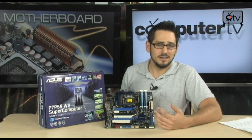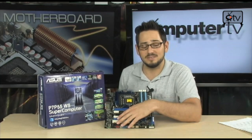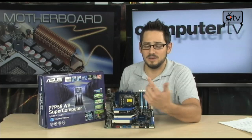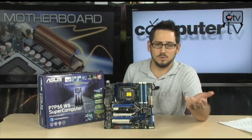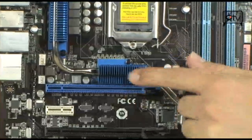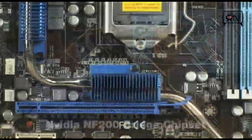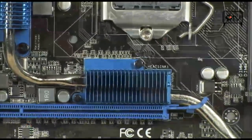How did they get a chip that only supports 16 lanes of PCI Express to have five PCI Express X16 slots? Like, how's that going to work — X1, X1, X1, X8, X8? That wouldn't be very fun. Here's how they did it: see this chip right here? It looks like a North Bridge, but there is no more North Bridge on P55 — it's a two-chip solution. So they added a third chip: the NF200 from NVIDIA. You've seen it before on Skulltrails and gaming boards. Basically, it turns 16 lanes of PCI Express into 32 lanes — doubling it.